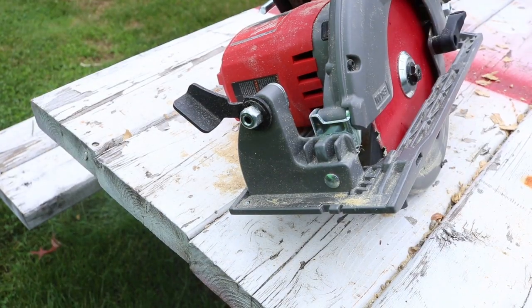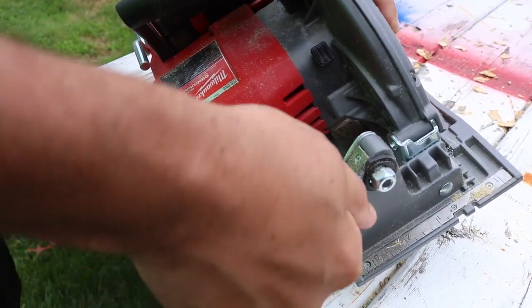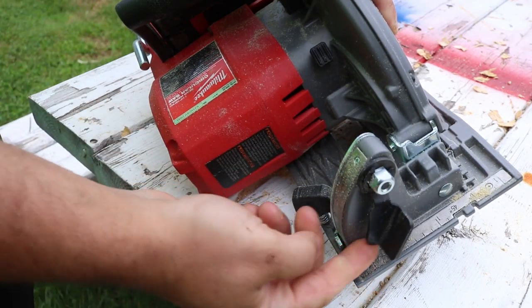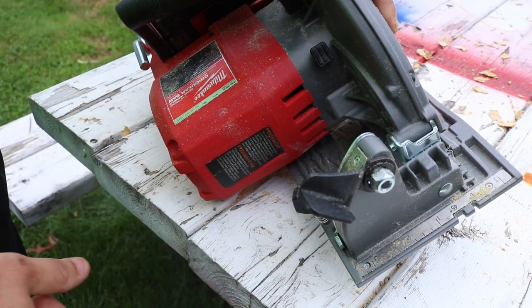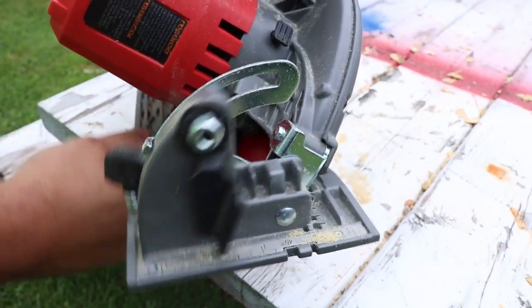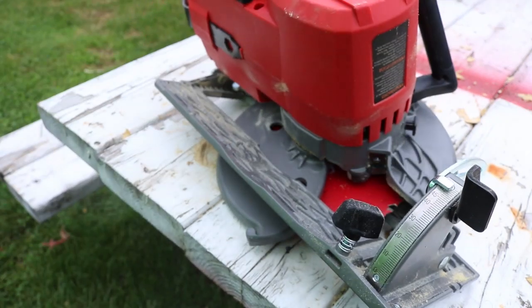where the Makita, but back in the Makita's corner, the Milwaukee, even though people don't care about this, doesn't have the positive stops. That's not even what's irritating. On every other rear handle saw that I have, there is a stop right next to the bevel lever. This one does not, and it will keep spinning until it comes completely loose. Not happy with that. Though I will tell you, the Milwaukee and the Makita both bevel extremely smooth. Very well done to both of them.